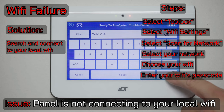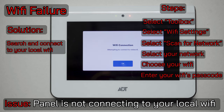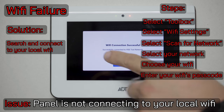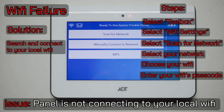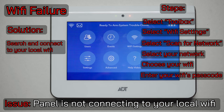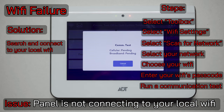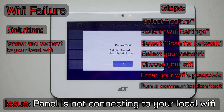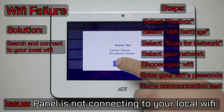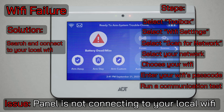In this case it's the HSE test network and I would enter my Wi-Fi password. Once I've entered my password, select save and then hit OK. I like to leave it on this screen to verify that it's successfully connected to the Wi-Fi network. Once you hit OK, back out one step, go into advanced and run a communication test. You should get passed under broadband, signifying that it is connected to the internet and transmitting signal to ADT. After you've completed that, simply back out to your home screen.